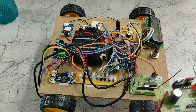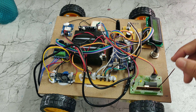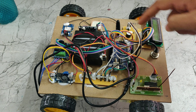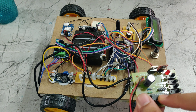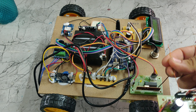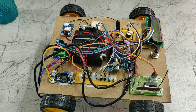Those radio frequency waves are transmitted by this transmitter coil. Based on each switch signal, it will generate different signals — up to 4 different signals — and those 4 different signals will be transmitted. This is the receiver. The receiver will receive the signals, and those signals are given to the Arduino board. The DC voltage generates an analog output, which is transmitted through the transmitter coil and antenna. This antenna receives the radio frequency in analog form, which is then converted into digital form using this IC.